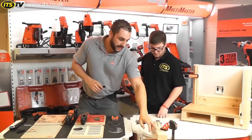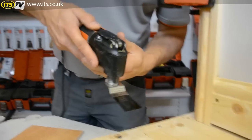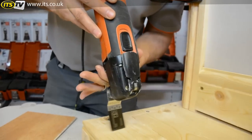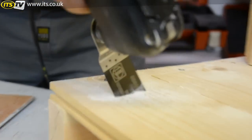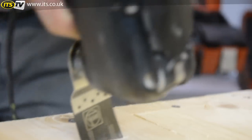If you're cutting clean timber — say we have a piece of timber here, or if you were cutting a piece of skirting or a door jamb — we know that it's clean timber, we know there's nothing else in there, there are no nails, no screws. So if you're cutting clean timber, a standard wood blade would be absolutely fine.